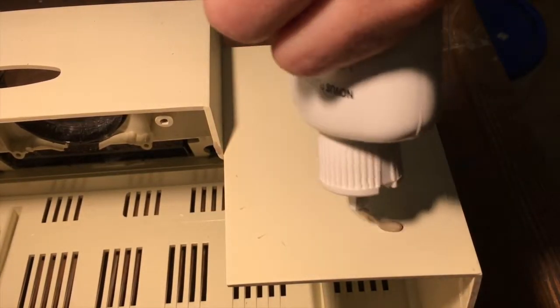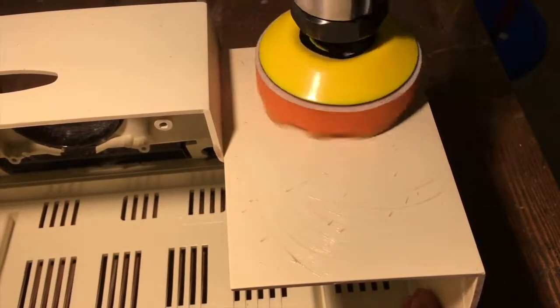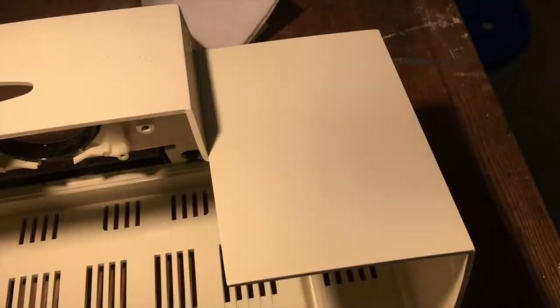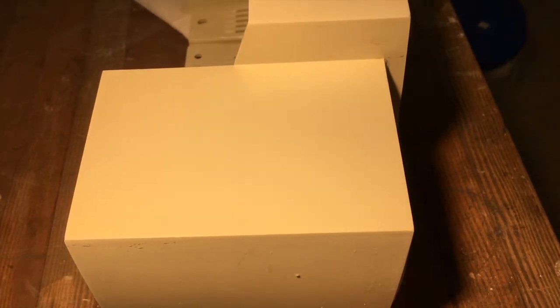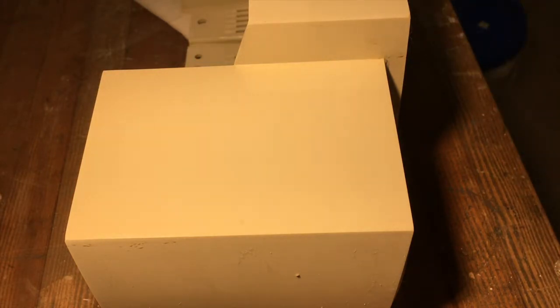Okay, I can handle this — so far so good. You can see already just that little bit is bringing the shine out compared to the part that's only been sanded and not buffed, but I can still see some sanding marks so I'll repeat that. For anyone wondering, I've got the air compressor turned down to about 80 PSI and the polisher on low — just keeping everything at a slow, manageable speed and hopefully not depleting the air compressor every two seconds, since it's not a very big one.